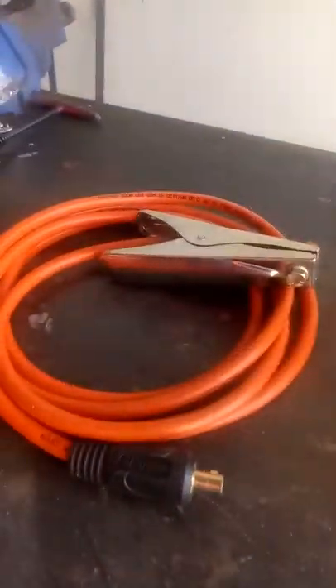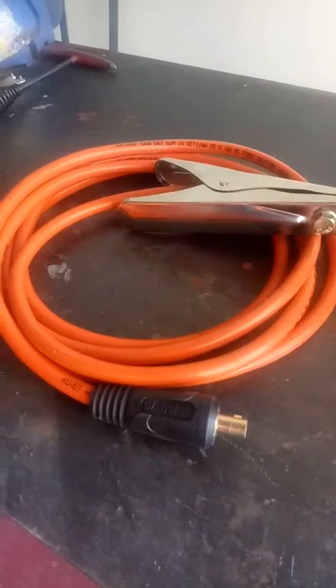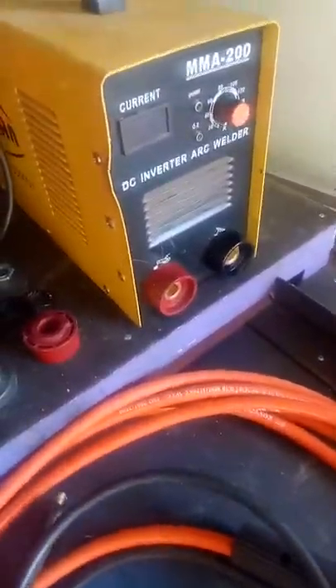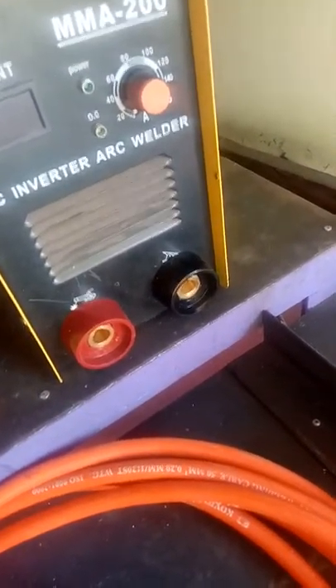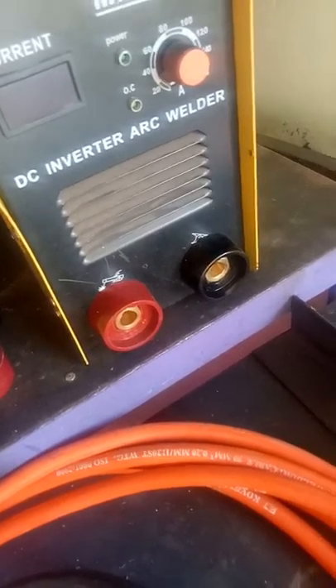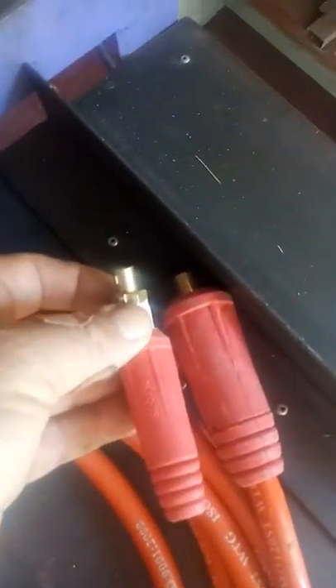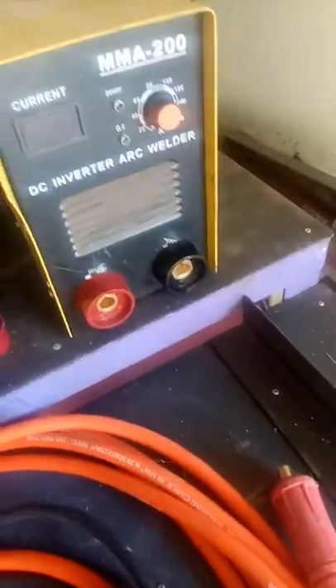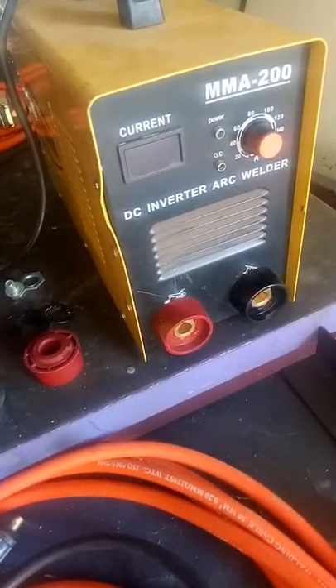I put 4 meters of the same size cable on the earth clamp and put new fittings on - not a big deal. The new fittings are easy to do if you've got an annular cutter to make the holes, because there are no holes to start with. With the old small fittings versus these new ones - big difference, big big difference. You can do the hole with your cutter, but mine left a little bit of burring on the hole.